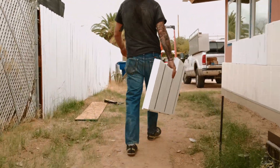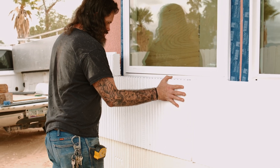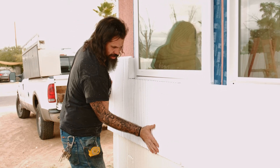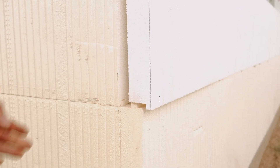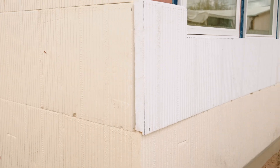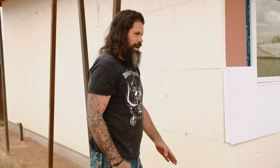I always test fit because this glue is gnarly — the glue is awesome, it works really good. The PLX3 I believe is what's specced out by Instafast. Another thing I always do on these window captures is I back-cut the groove — I cut it off — because there's no way to put it on the tongue and groove assembly and then squeeze it under the window. I haven't seen that in the Instafast world, but I couldn't imagine how anybody would do it without back-cutting the groove out.